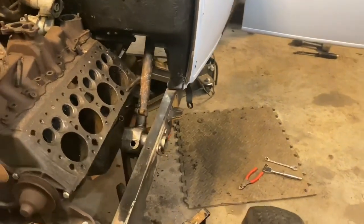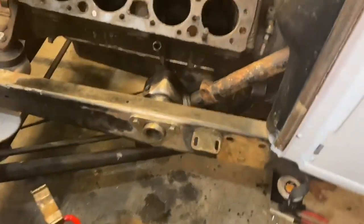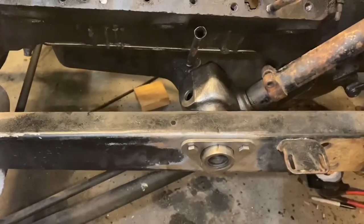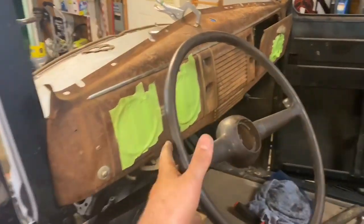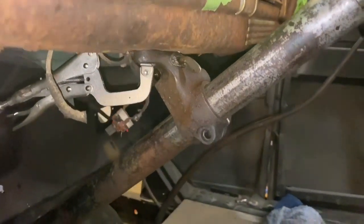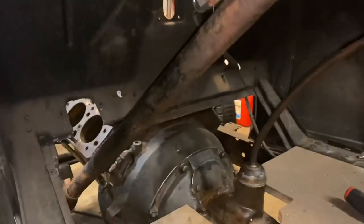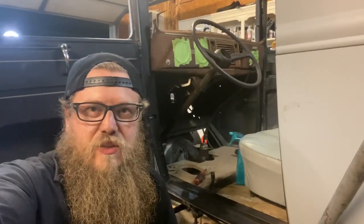Here's my steering box after all modifications are done. It's officially bolted into the car, I've got my steering wheel on, and the only difference right now is that it's gutted — I don't have the internals in it yet, but I think it looks pretty good. The inside plate's welded, the new column's on, and the 39 shaft's welded on so my steering fits the 39 steering wheel. The drop column isn't bolted on yet — I have to drill holes into my dash — but I love how it's going to look. Now it's time to wrap my pedals around the steering column. That does it for the steering column — everything else is just putting it together and painting it. The hard part's out of the way. If you enjoyed this video, please like it, subscribe to the channel, and shoot me any comments or questions. Thanks for watching.